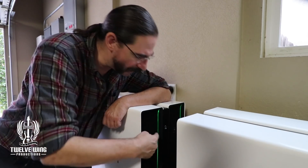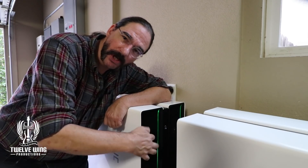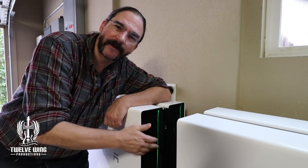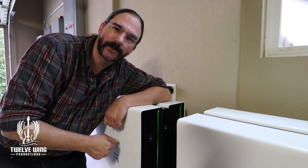There's no point starting from a completely dead battery. On the side of the Powerwalls there are switches — go ahead and turn your Powerwalls off until you get your permission to operate, and then turn them back on.